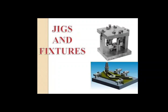Bayonet clamp. It has a partially threaded cylindrical clamp. A part of the groove in the bayonet is straight. Movement of the bayonet is guided by a spherical ended screw mating with the groove in the bayonet. It can be pulled back straight axially through the straight slot to provide enough clearance during workpiece loading and unloading.